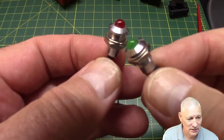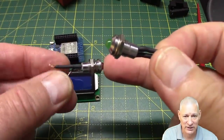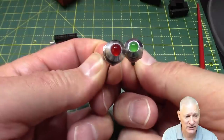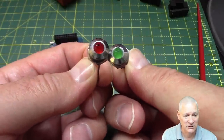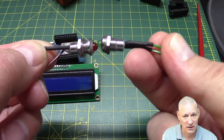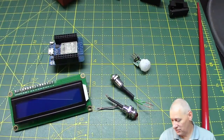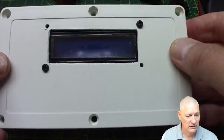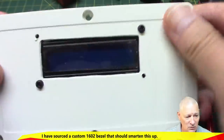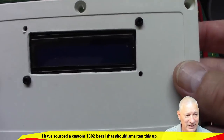I've got two little LEDs — one red and one green. I thought about a dual LED but I haven't got the skills or tools to make the holes in the lid line up exactly with LEDs on the PCB as a commercial unit would with standoffs and apertures. Instead I've had these chrome LED holders in my toolbox for about 30 years. They take about 13 milliamps each, which a GPIO pin on an ESP32 can produce, driven via a 100-ohm resistor. Red means heaters on, green means standby mode — they can flash to indicate errors. They can be screwed directly through simple holes in the lid and will look quite smart.